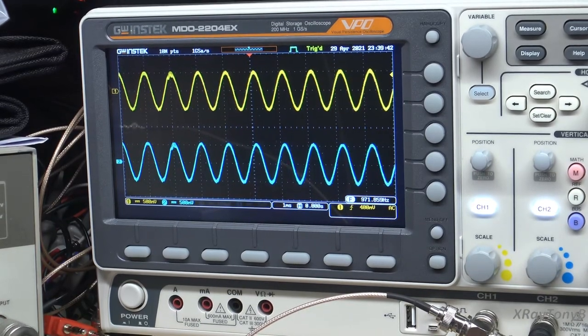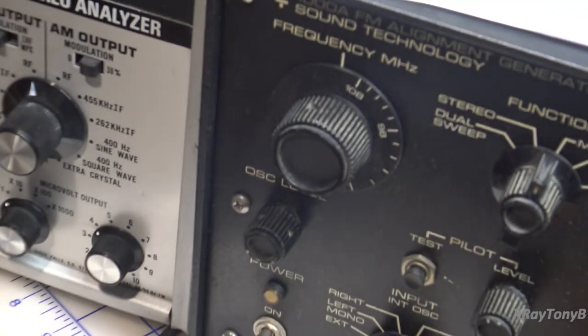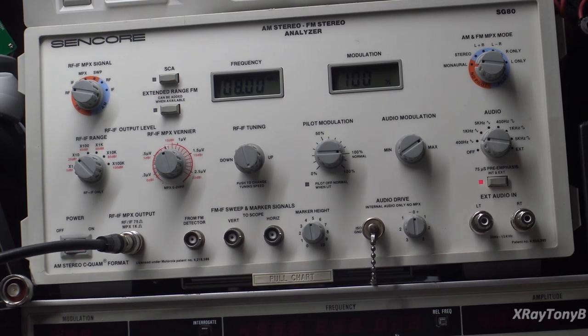Using the Sound Technology ST-1000A, there's your 1 kHz instead of 400 Hz — and it's pretty much on. Again, it stops at 108 MHz, so you need a frequency counter to set it. For these next several steps, I'm not going to demonstrate on the SG165, ST-1000A, or the HP8657, simply because the process is exactly the same as what we just did — setting a frequency, setting an amplitude, dialing the tuning scale to that number, and making an adjustment. So we're just going to do all that on the SG80 because it's the same thing.